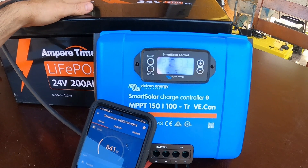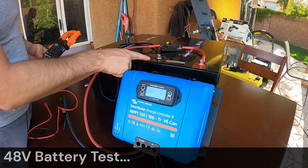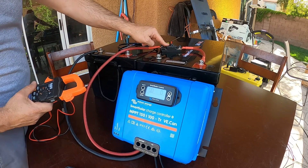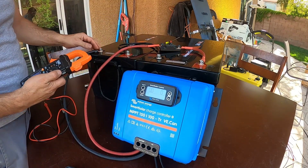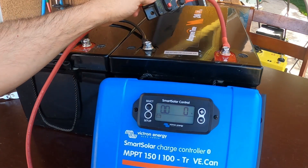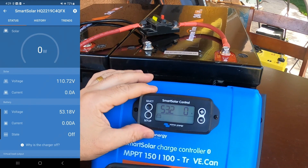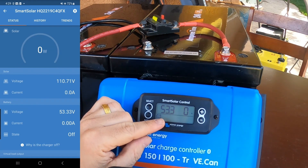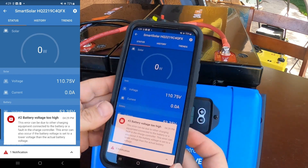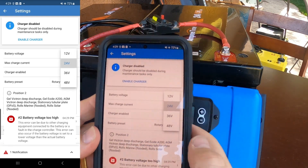Let's connect another one of these batteries. We'll connect them in series and see if we can get a 48 volt battery going. We have two 24 volt batteries connected in series: positive, negative, positive, negative — main positive, main negative. Breaker is off. Quick voltage test: 53.4 volts. Now let's do our 48 volt test. We'll flip our breaker — we'll probably get the same error. We got our battery voltage error. Go back to the settings, now we're going to do 48 volts. This unit also does 36 volts, but we're not going to test that. Enter the code 5579 — very easy to change batteries.